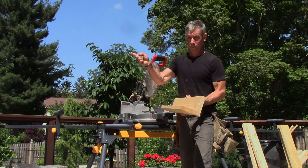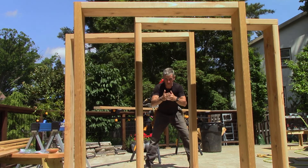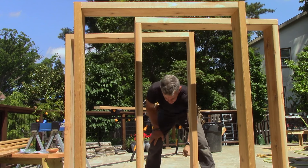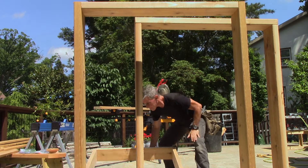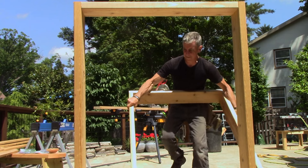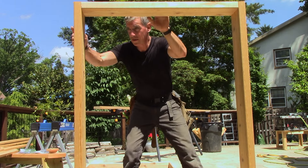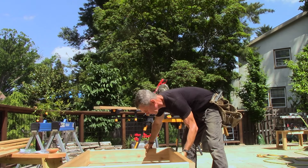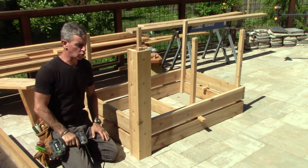Now that I've got that, buckle up — we're back on track. To get the box joint look we're looking for, with offsetting butt joints running up the side of the compost bin, I'm going full width: four foot six, thirty-three. Then for the next one, I'm going thirty-six, four foot three. And what that does, just like the raised garden bed we made, it offsets the joints to look like a box joint. The previously mentioned corner boards go on the corners.